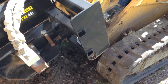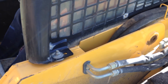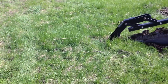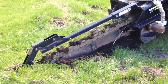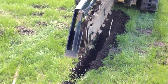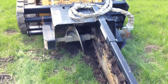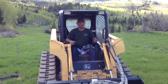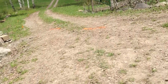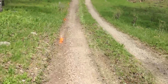Part way into it I realized I didn't know where the phone line was. Until we got the phone company to come out and mark where our phone line was, we started digging with the trencher on the other side of the driveway. It digs quite nicely but when it's very cold and wet the trencher tends to slip rather than dig. We had the phone company come in and show us exactly where the phone line goes from the road all the way down the driveway, and they marked it so we knew exactly where it was all the way up to the house.